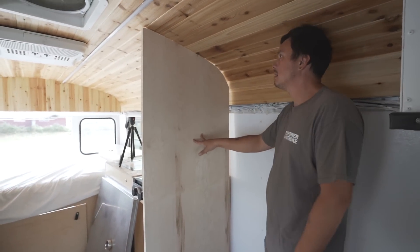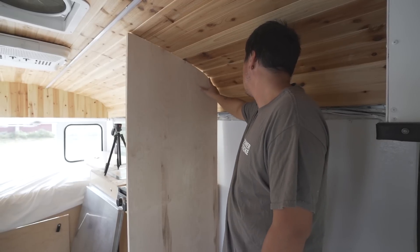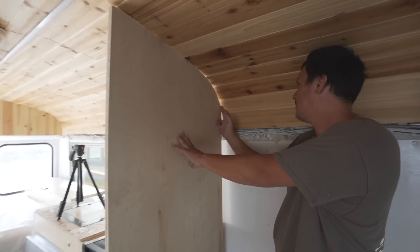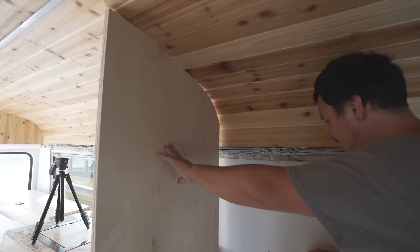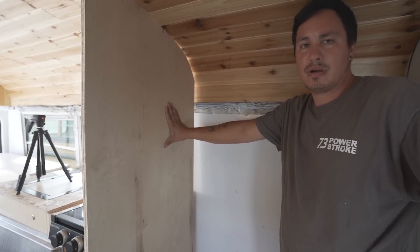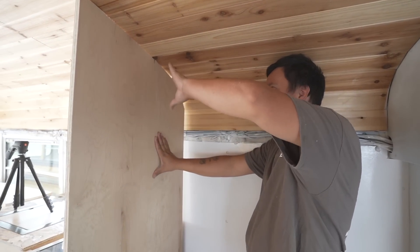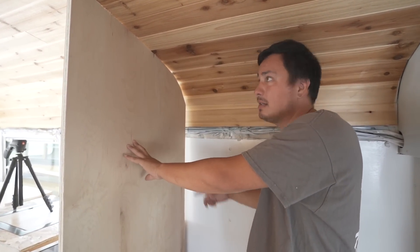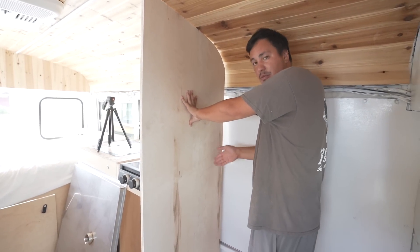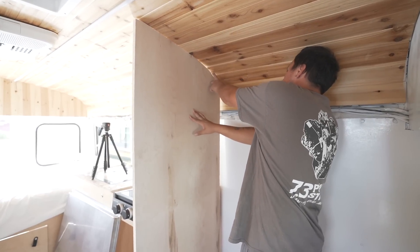I think that's it. Obviously it's not perfect so we're going to have to fill that with a caulk line. We deleted these windows because I've sealed up against windows before and I think it's a super leak point — caulk lines break. With a fully sealed shower, if a caulk line breaks you can just re-caulk it, and the water isn't going to go anywhere except inside the stall. Versus over here it could start getting between things and creating mold fast.